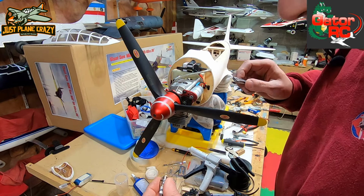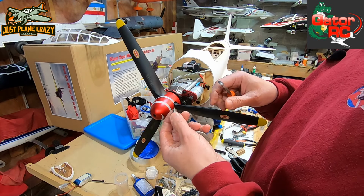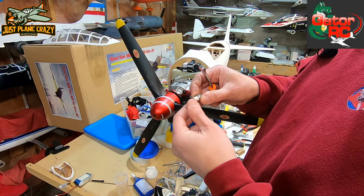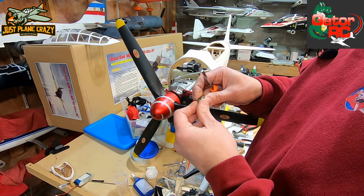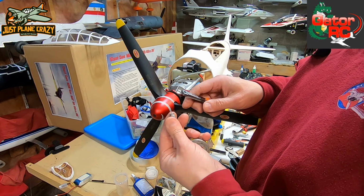If you ever drop a spark plug, for what the price of these NGK CM6s cost, I would just simply replace it. You don't know if you have cracked the porcelain and will have ignition spark jump or crossover or short, and it's not worth it. So try not to drop them on the ground.